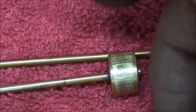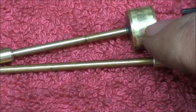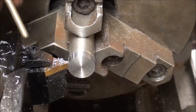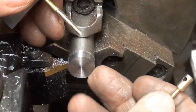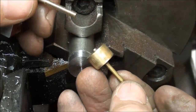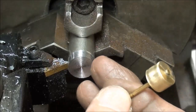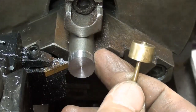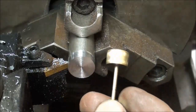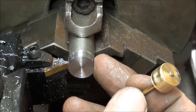The next job is the piston. I'm going to make it out of steel this time instead of brass — not as much scuffing, as you can see scuffing took place on this soft brass piston even in an aluminum cylinder. Of all the material I have in the shop I couldn't find any half inch stock that wasn't a little bit under, so I'm starting with 5/8ths stock and turning it down to a half inch — 500 thousandths — then checking for fit. I'll polish and file until I get a perfect fit into the cylinder, then cut it off. I'll also center drill it and drill 3/32nds for the rod, working very slowly as I get down to dimension.